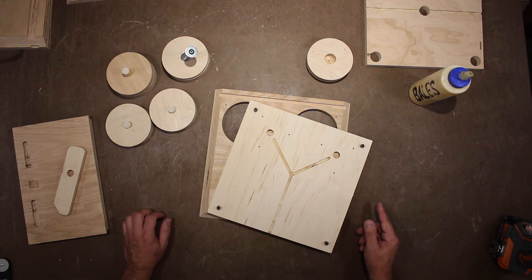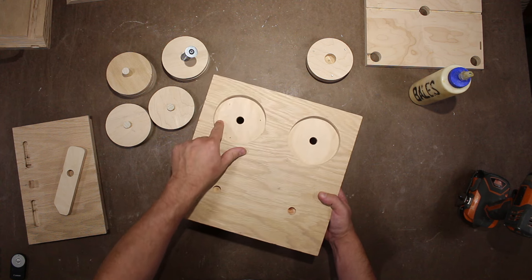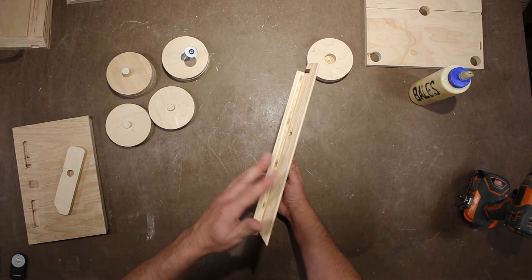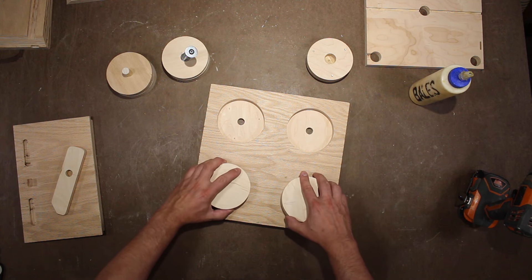You're probably asking yourself how all these parts work together, and that's a great question. This half-inch panel, which I'm calling the subtop, gets secured to the three-quarter inch top. This creates a base plate for the two working studs, and also helps with alignment during assembly since the tops and sides are mitered. The two front studs are stationary — they're an inch thick — and I added centered dowels for perfect placement during glue-up.